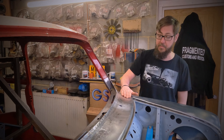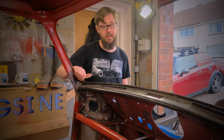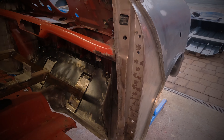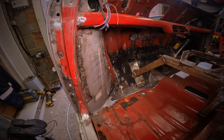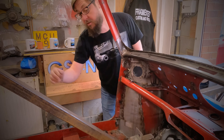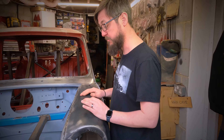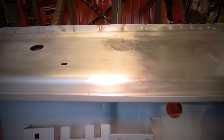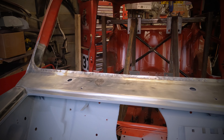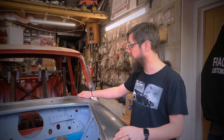We've got a new scuttle panel, a brand new top dash rail, and repairs on the window frames on the A-pillar, so we've done quite a bit around the full front end. The main original panel is the top of the subframe bucket — it's had the new section fitted at the bottom and that will join to the new floor panels seen earlier. We've also done some slight custom touches and deleted the wiper holes for left-hand drive, so instead of plastic bungs filling those gaps we've welded them up and will get them filed down and flattened off ready for bodywork and paint.